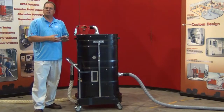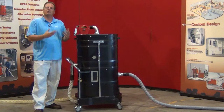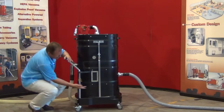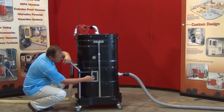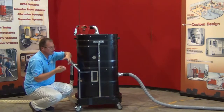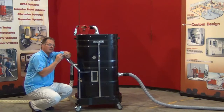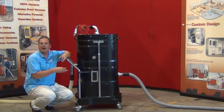So if you need to submerge the material prior to entering the vacuum's filters or the vacuum itself, immersion separation systems should be used. The design is quite simple — you fill your liquid up to the arrow as indicated on the sight glass. The sight glass tells you what's going on with that turbulent water. As you mix that material with that turbulence, there's a dispersion screen in here that knocks the particles apart, creating a fine mist and knocking the dust out of the airstream.